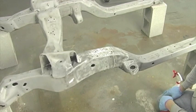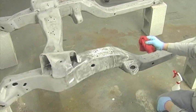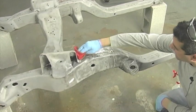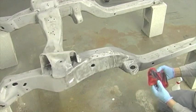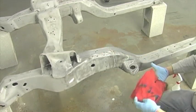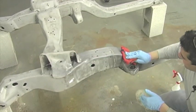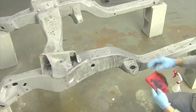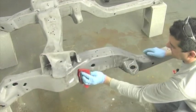The foaming action is cleaning, degreasing, and imparting a zinc phosphate coating. The phosphoric acid etches the metal — you can see the contaminants coming right off — leaving you with a rust-free, paint-ready surface. The zinc phosphate coating is excellent for all paints, primers, and powders.